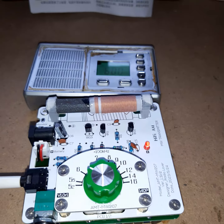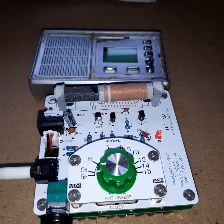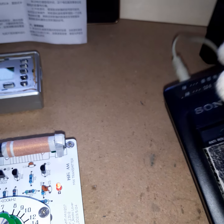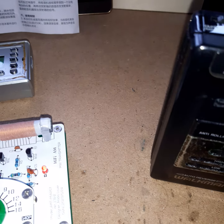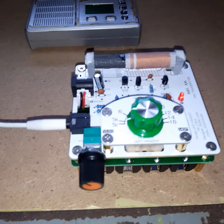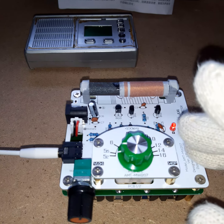The next thing I want to check is the modulation quality. The modulation quality is at its best at the bottom of the band — I'll come to that in a moment and show you what parasitic FM means. But first we are going to have a listen to how this thing sounds. I have some active speakers here, two of them. They are going to replay what is being transmitted. I have my vintage radio — let's align it. The audio quality is really good. I have to give it a point for that: the audio quality is decent to really good.